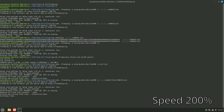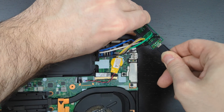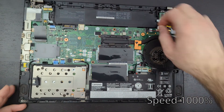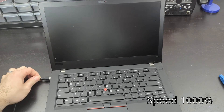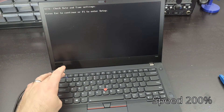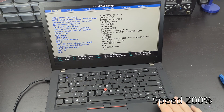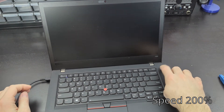Flash the Thunderbolt chip with the fixed Thunderbolt firmware. Once done, disconnect the Pico and remove the clip from the Thunderbolt chip. Reconnect the batteries, loosely attach the back plate, hook up the external battery, and plug in the charger. It'll boot up and reset a couple of times. Once you can get into the Lenovo stock BIOS you're good — turn the system off and we can start flashing Libreboot.